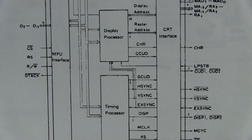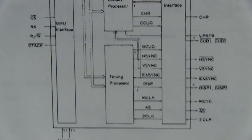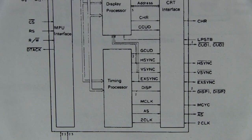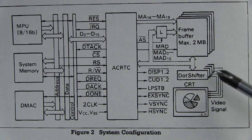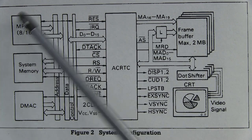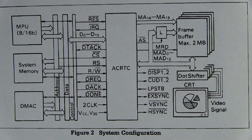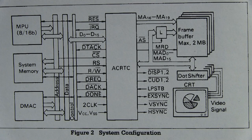They don't really have this sort of thing anymore. Advanced graphics cards, sure, but just dedicated CRT controller chips — timing processor, MPU interface, DMA control units, drawing processor, and then the CRT interface which handles all the syncing. There's a system implementation diagram, and there's that dot shifter. That looks like it's a separate thing. We're going to have our main CPU we haven't found yet, our main system memory, direct memory access controller, and up to 2 meg frame buffer just for the CRT controller. That dot shifter is probably dedicated external circuitry — we might have to find that one too.